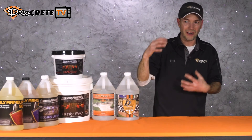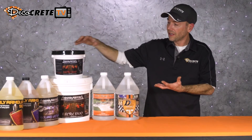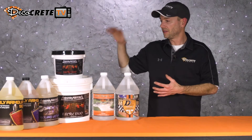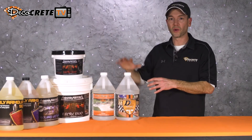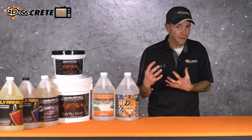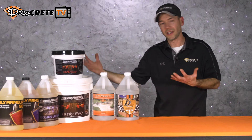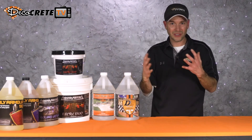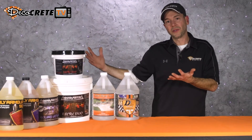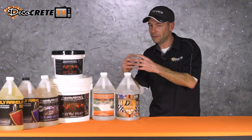Going back to chemical makeup — epoxy, urethane, polyaspartic are all different resins, but they have one thing in common: the film they leave behind is going to be a lot more dense than acrylic sealers. That means we're going to have to have some really open pores in the concrete, or maybe even a profile into the concrete, in order for this stuff to actually grab on. If we put a concrete coating on unprepped concrete, it's not really going to hold up long term — the film will form and everything will seem fine for a while, but it's just not going to really grab on and last. That denser coating also means fewer air pockets, so it's letting less moisture pass through.